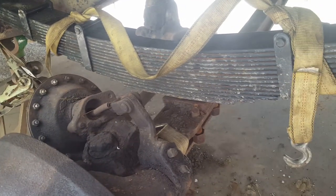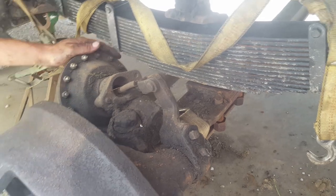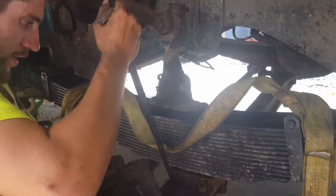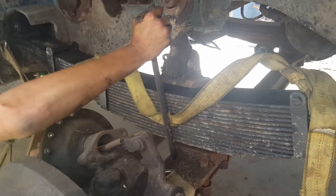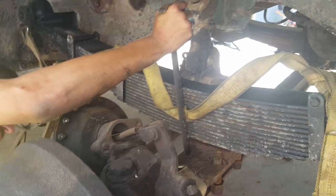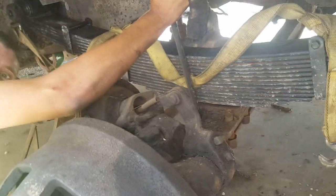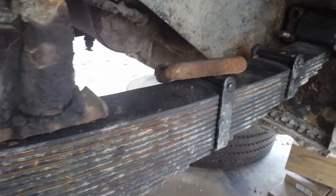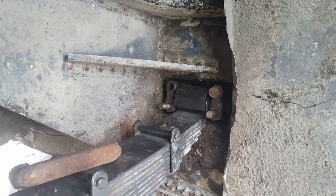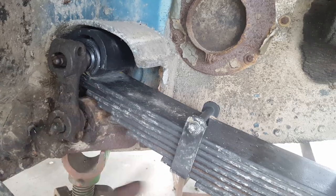Okay, now where's the pry bar? There we go. That's going to be hot. Alright, jack up a little bit. Go down a little bit for a second. For our end of the day we've got our U-bolts — Crosby's going to go get those made up for us tomorrow morning. We've got to get another bolt up there; it was stripped. We still need a pin for the top one. After we get our pin we can get it all bolted up, but it's at least hung for now.